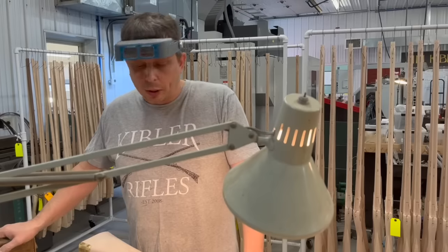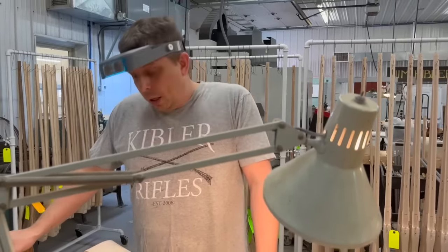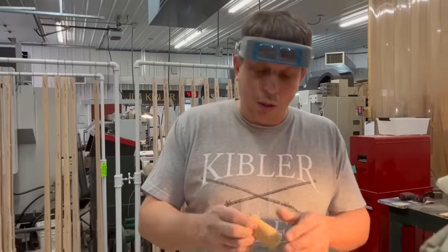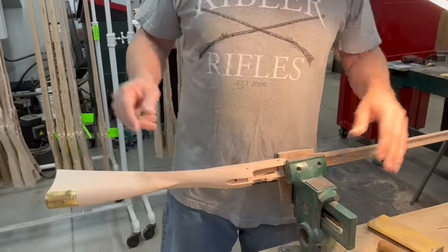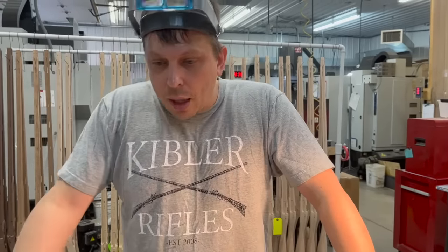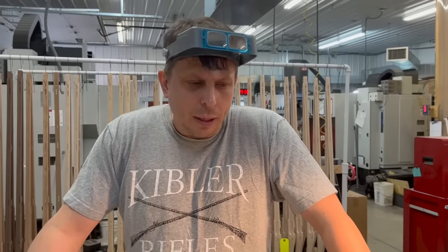Okay, so what's next is I'll finish up this 150 grit on the other side of the forestock, and then we'll start with the 220 grit. So the 220 grit will be, like I said, very much like what we're doing with the 150 grit. We may use the paper a little more, not back, maybe fold it over one or two times. You can get away with it, and maybe just a little quicker and easier that way. And then we'll go to 320 grit, same as the 220 grit. Some people like to stop at 220 grit, but I think it's better to go to 320. And then we'll raise the grain. So I'll probably come back to the video here and show you some of the 220 and 320 process, although we won't cover it as in detail. Show a little bit of that, and then after that we'll skip ahead to the grain raising.